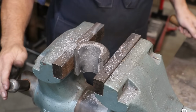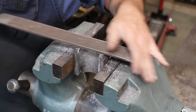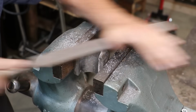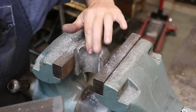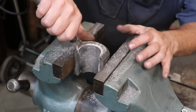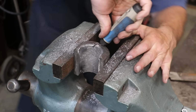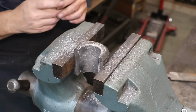Using the little disc as a dam, you end up with some nice ends that don't require a whole lot of cleanup work. With the damming material only, sometimes you'll get a really ugly looking end, won't be flat like that. And I'll just use a deburring tool to go around this and get a little chamfer on that outside edge.